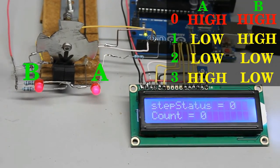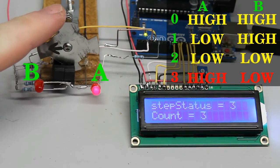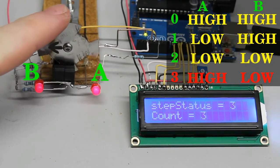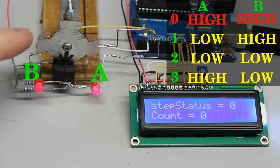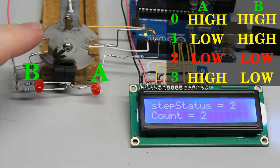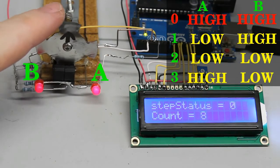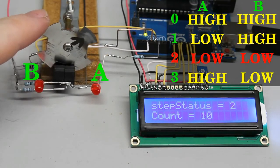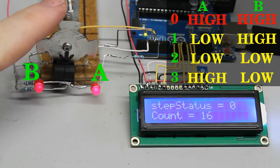The variable is increased by 1 whenever the microcontroller detects clockwise rotation. The variable is decreased by 1 whenever a counterclockwise rotation is detected. If the status at one of the input pins changes, the disc has been spinning for one step. For a full turn, the cycle from 0 to 3 is processed 4 times; the input signals change 16 times, thus the full rotation is divided into 16 steps and the rotation can be measured with a resolution of 22.5 degrees.